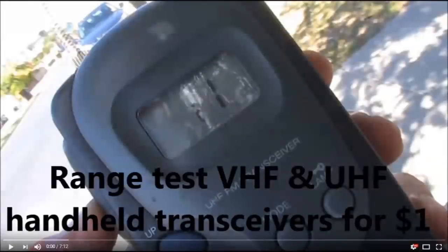A little while ago, I described a VHF UHF FM handheld range tester. The idea was it could determine how far your mobile or home station could pick up a signal from a handheld, and you could know that information without being at home. You would get feedback on your handheld — a burst of carrier that would tell whether you've been received or not. It was very simple, just a transistor connected to the speaker connection on the set at home, along with a few other parts that pushed the PTT button to give you a short burst of carrier.